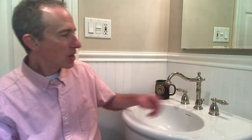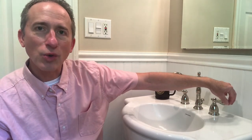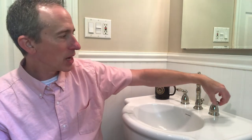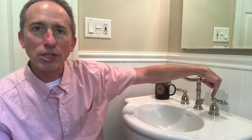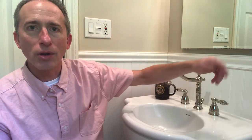So from time to time, go ahead and loosen these things up and just check how everything's going. Once you hear this starting to get a little creaky, like a little squeaking there, that's a telltale sign that you need to replace the cartridge. So as soon as you start hearing that, give the company a call and they'll send you another one, I think for free, though I can't vouch for that. I'm not 100% sure with this company if we'll get it for free.